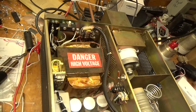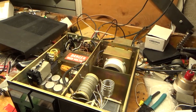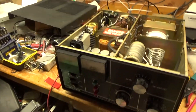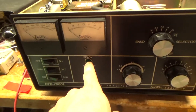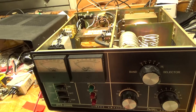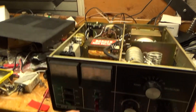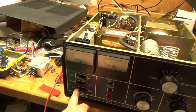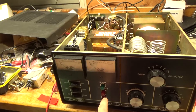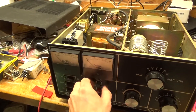I'll be selling this right after my wife puts the video up. One other thing: the ready lamp is out. I don't know where to source these, but these two lamps work. When the delay time has elapsed, normally the ready lamp comes on as long as it's on the CW position. When you select SSB, the SSB lamp lights; when you have it keyed with the foot pedal, the transmit lamp lights. These two red ones work fine — the ready bulb is out.